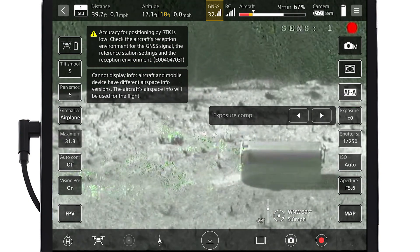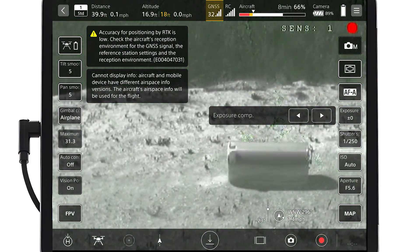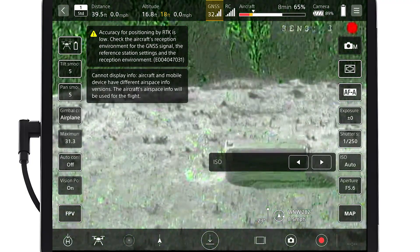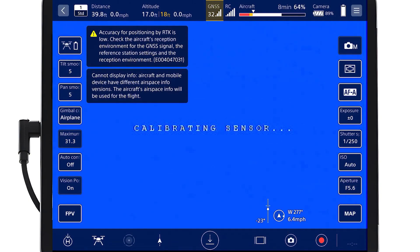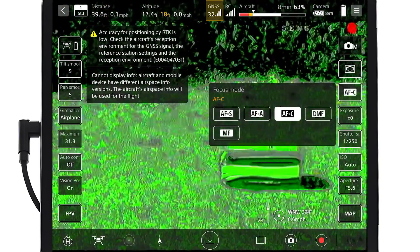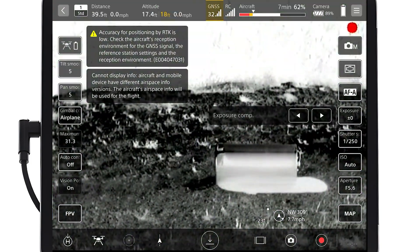If we move the drone a little bit, you're going to see the screen turn a little more green — that's okay, you just have to let it settle. This is showing the movement on the screen, so it's a lot easier to detect. We can also go to the exposure here and turn up the sensitivity, and you're going to see a lot more turns green, but you're going to see the leak a lot more clearly. So let's capture an event — we have the recording. We'll go back to the regular mode, do one more nuke, and now you have a nice clean image of the leak. We can turn off the GEM mode and go back to white hot mode.